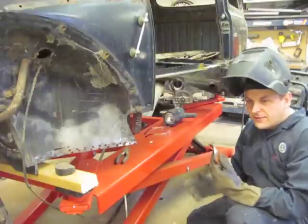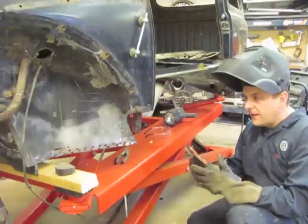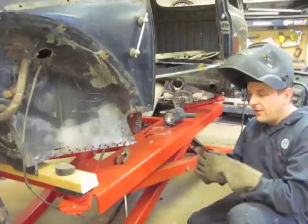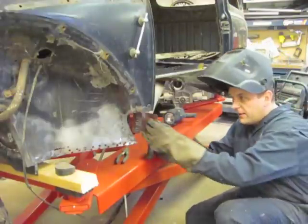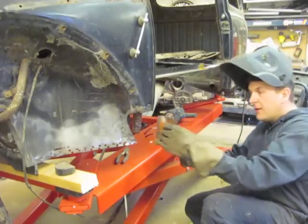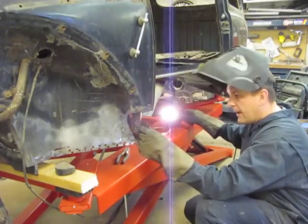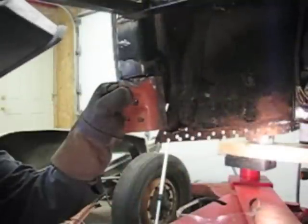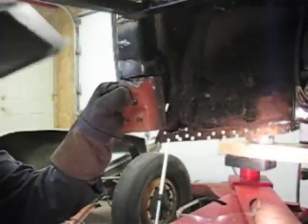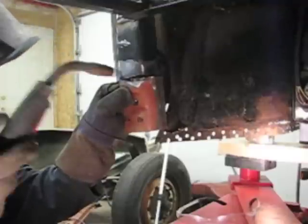Typically when you're welding heavy steel, you want to clamp it into place. I find with sheet metal, if you have a nice thick glove and you're very careful for the initial tacking, you can just use your hands to hold it in the exact spot that you need. Now I'm going to put this up into place. It's always handy to have a bright light around when you're welding. If you just find a place where the metal is lined up exactly, use that as your first spot.